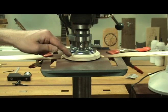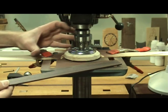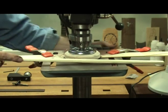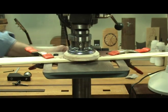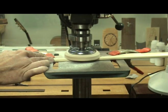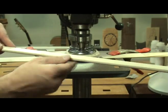I've got 150 grit paper on my disc and as you can see, it leaves a nice smooth finish. This tool puts out a lot of dust, so at the very least wear a dust mask — rigging up a dust port for your vacuum is even better. Here's a piece of brace stock I've milled that has saw marks on the side. I'll use the sanding disc to clean it up, and now it's smooth and ready to install in the guitar without any saw marks.